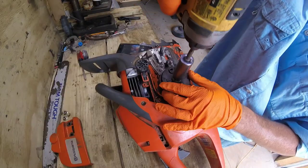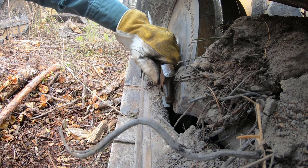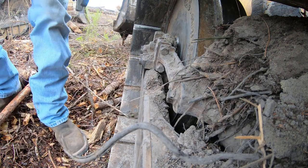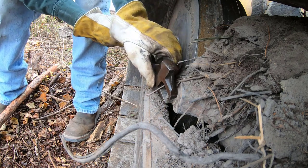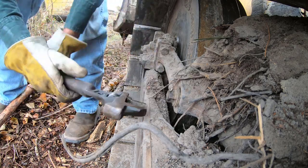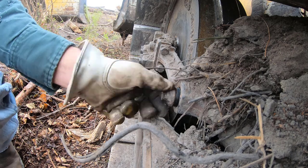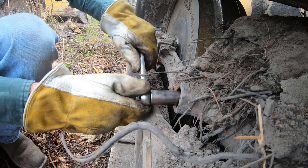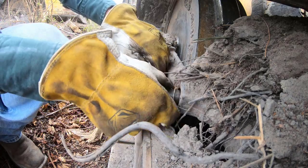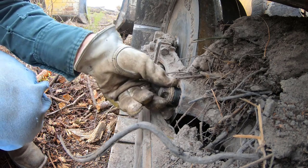Let's tear down! I'm going to start by letting the tension off of this thing. Keep in mind, this is a metric adjustable wrench — not to be confused with the standard. It's metric left-handed, because it's John Deere. Pun intended. Right in here, it's a three-quarter socket. Let that tensioner off so we can let the grease out of it. We need to clean this out right here and take a look, so we don't get dirt in it.